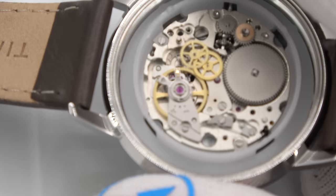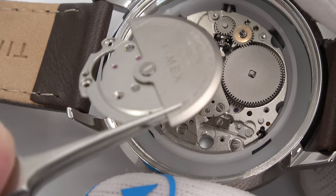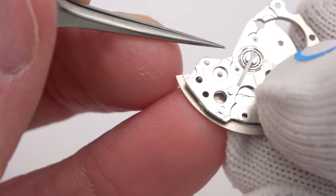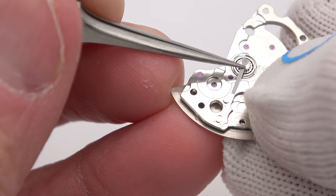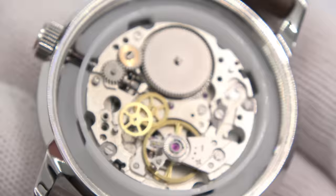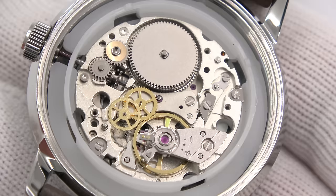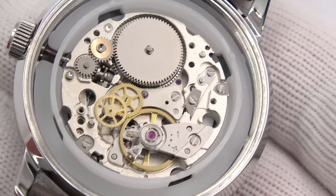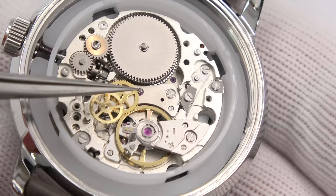Back to semi-normal mode. This is the auto-winding bridge with the auto-winder attached. I flip it over — you see this little leaf spring right here? That pad, when you put the auto-winding bridge on, presses against the top of this gear here and basically just prevents it from jostling around because of the loose fit. It's called a second hand brake — not in the way of a hacking lever, it's actually physically a brake. It slows or kind of eliminates the herky-jerkiness of the seconds hand. Some people do decide to try to mess with the brake a little bit, make it a little bit weaker so that it doesn't happen as much.